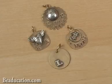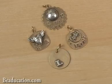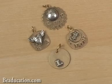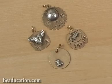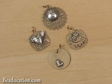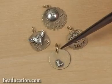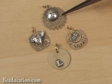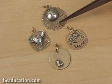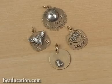You may notice that all of the pendants sitting here in front of me are gold filled blanks that have sterling silver elements soldered to the top. Gold fill is actually very simple to solder and you would follow the same steps outlined in our simple soldered pendant class using copper and silver. The thing to remember about gold filled is it is a carat gold that's clad onto a brass or base metal base, so you want to make sure that when you're soldering you don't let your torch linger over these metals for too long or else you're going to burn through the layer of gold on top and expose the base metal below. You also want to be careful when antiquing the pieces that you don't polish them too aggressively and polish right through that gold layer. The gold filled layer on these is pretty thick so you don't need to be too delicate — you just want to be aware of its limitations.